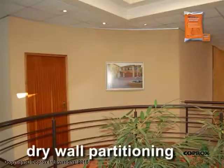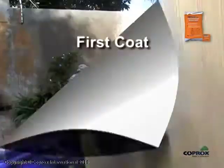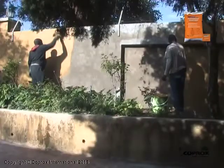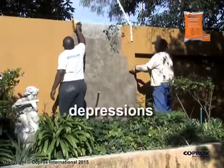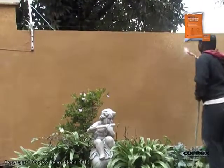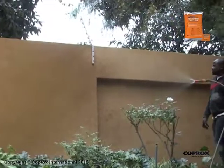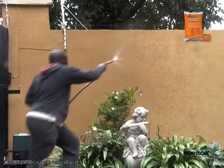In the case of drywall partitioning, the Koprox Waterproof Dual Coat is applied onto the dry oil-based primer. First coat: Key the surface, then liberally apply the Koprox Waterproof Dual Coat to the keyed section using a suitable brush. The brush type will determine the texture of the application. Ensure that all depressions, fine cracks and pinholes are covered. Once the Koprox Waterproof Dual Coat visibly begins to dry, cure the application by evenly wetting it with a fine mist spray. Repeat this procedure one or more times to minimize crazing and powdering. In hot climates or high temperatures, cure the application more frequently.